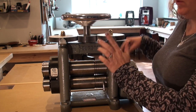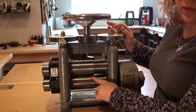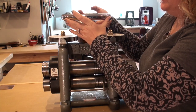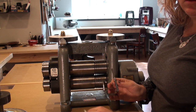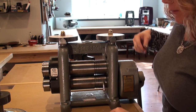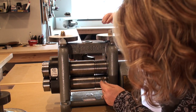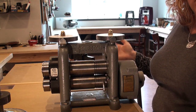Once the snap ring has been removed, you can lift up and remove your handle. It's important that you start with your rollers slightly apart at this point, because it's a little easier to get your gears to move. I'm going to lift up my handle and put it off to the side. I've selected the same measurement for my feeler gauges — it doesn't matter what you pick, as long as they are the same. I'm going to come in and use the outside ridge on my wire rollers, because the outside is still flat, as my point for inserting my feeler gauge.